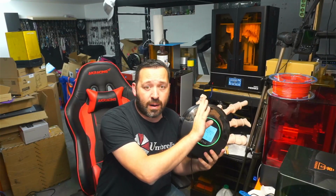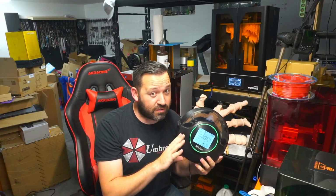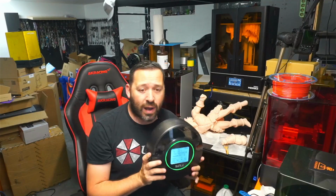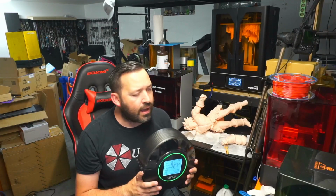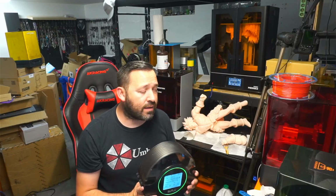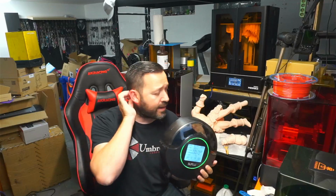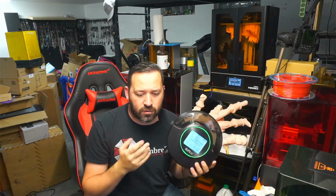This has been out and about for probably about 2 months, I want to say now. So it's probably not going to print very well if I were to throw it on one of my machines and just hit print. So I would want to put this in there at least overnight just to try and gain some of that back, and then keep it in there while I was printing. That way it can consistently keep heating this element and drying this filament out as best as it possibly can while it's printing, because you can only get through a certain amount of layers, and that's basically all you can do to keep it as dry as possible.